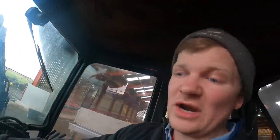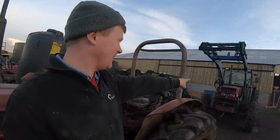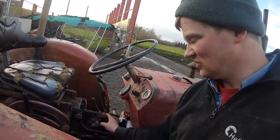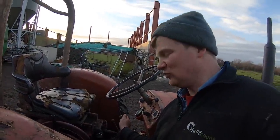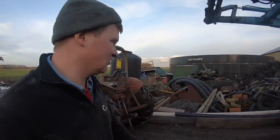That was close, and this is tight. Jeez Louise. This is why we have little scraper tractors. Did well, the big beast. Good news is Max and BNR Mechanics have looked at it and they showed me how to do it as well, which was great. They're not the biggest fans of being on YouTube, so what he told me I can tell you. That there is how you get into the gearbox — it's got a little pin, you just punch it out, a little bit of a magnet, take it out. It was just not in the sliders correctly. It's got three sliders — in neutral they're meant to be three together, and one of the sliders was out, so that's why I kept finding a gear but it kept stalling. You've just got to be a bit gentler — it might have been forced in a little bit, so when driving forward, literally stop, then change gear. We all rush around in scraper tractors, flying around, wanting to save those two or three seconds, and those two or three seconds have probably cost a good bill.